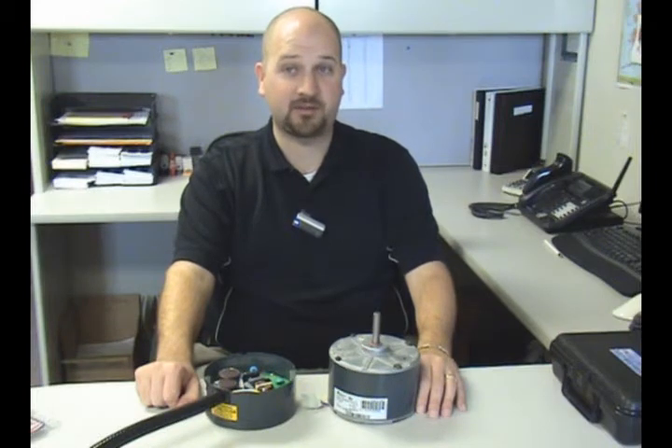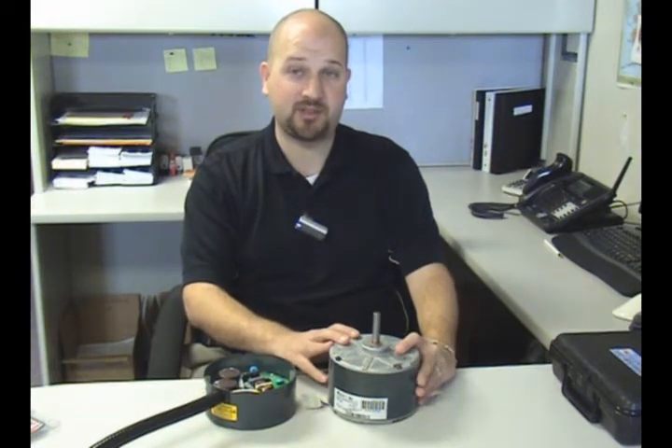Most of these motors can be replaced by either purchasing the whole motor, typically $300, or just the electronics module, sometimes less than $100. The winding section cannot be purchased separately because if it becomes electronically damaged, the module will be damaged as a result. If you need to replace one of these motors or its components, you must get the matched module or motor designed for this particular equipment — there is no generic one-motor-fits-all. Several states have enacted legislation making it illegal to replace any energy-saving motor with a PSC or non-energy-saving motor.